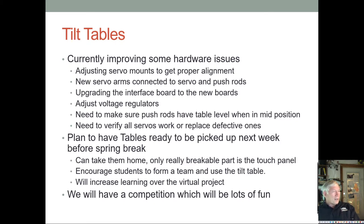But in any event, it seems to be working great, and I think that's going to give us a level of safety we've never had. One of the problems with the touch panels is you can't tape them down very well, because if you tape them too much, then you destroy the touch function because you create a touch where you put the tape. So you kind of have to secure them by their bottom. Normally that's done with a little bezel that goes over the touch panel, just like a normal computer touch screen. There's a little metal bezel that goes over it and holds everything in place. It only works on the edges and leaves all the touch surface unencumbered. But we didn't really have metal bezels for this. And I think it looks like the super glue is going to work great. So I'm very excited about that. Okay.